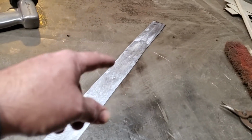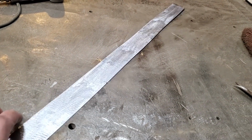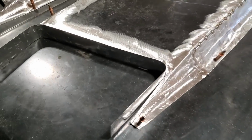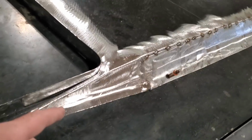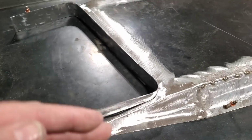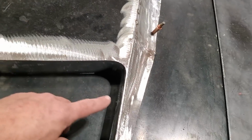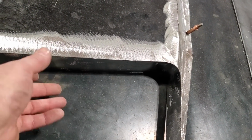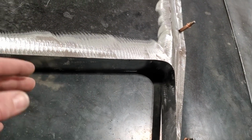I went ahead and cut two strips out, 30 inches long, and I cut them about 2 inches wide, bigger, longer, you know, the normal routine, right? Then I went ahead and came over here and bent it up to fit around the opening here. The reason I'm doing this is because I want to have everything the same all the way around. I want to have it perfectly vertical. A lot of this will be cut out after the fact, but in order to get the proper look, you can probably put a little strip in there, but it'd be very hard to get it all right.